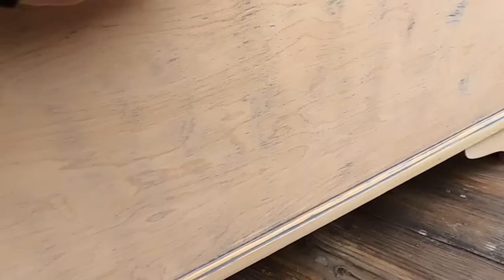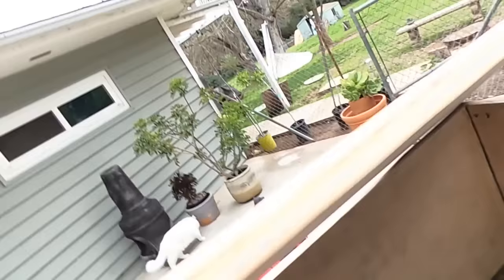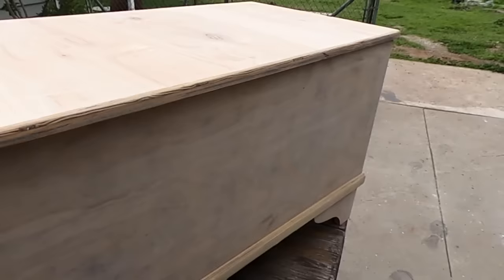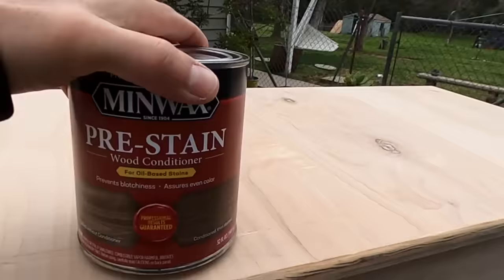I've sanded as much as I'm going to go, and now it's time to stain and wax. On the inside, I got most of the paint off - I'm leaving some on the bottom and just putting contact paper down there. The sides have a little character. It's pretty much just plywood in spots where I sanded a little too much trying to get gobs of paint off. Next step: pre-stain. Pre-stain helps even out the color on the wood so it's not blotchy. I'm not really sure if it works, but Matt thinks I should do it so I'm going to do it.